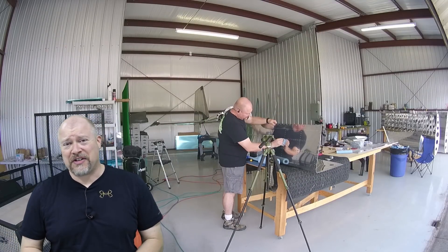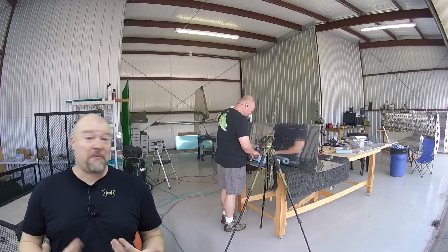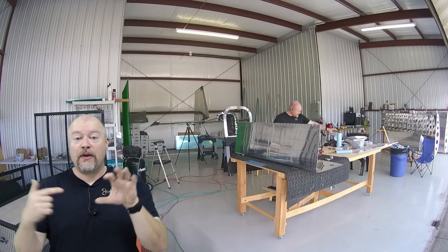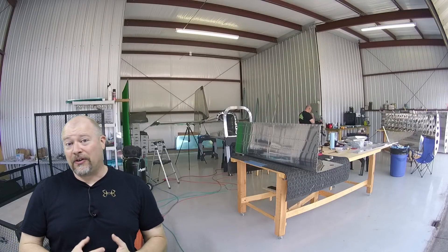Either way, you come up with the same result. There's just a lot of waste when you do it from the front. My suggestion — the way I found the best way to do it — is just apply sealant to each of the holes from the rear side, and a little bit will poke through. Then when you put the rivet in, it will kind of spread that out, and you'll seal the rivet just fine.